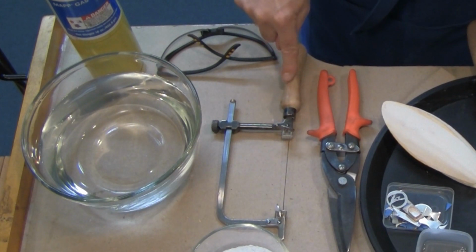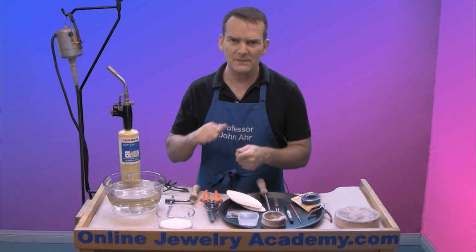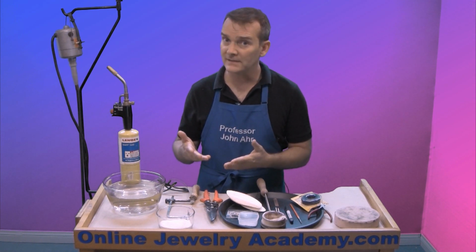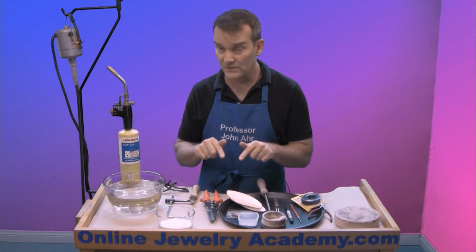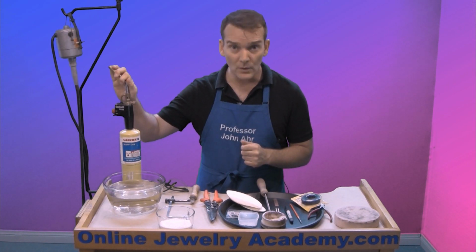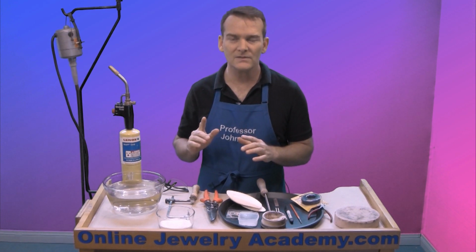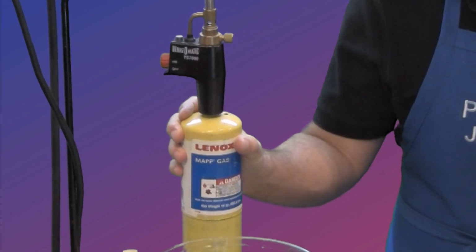And I also have a jeweler's saw frame here. Now, I'm going to use that to manipulate the cuttlefish bone, and you could also use it to clean up the casting later. Now, you're going to need a heat source to make the material in the crucible melt, so you're going to need a torch. Now, if you check out our other video on torches, you can see the differences between them, and I would recommend using either the acetylene torch or this one here. This one is fueled with MAP gas.